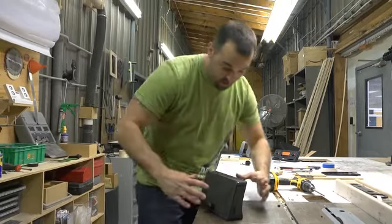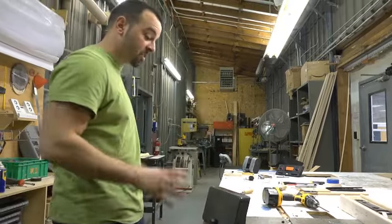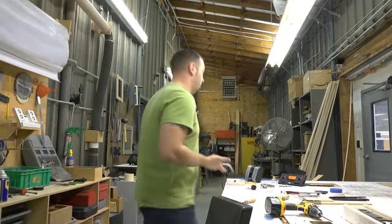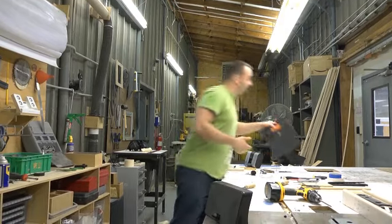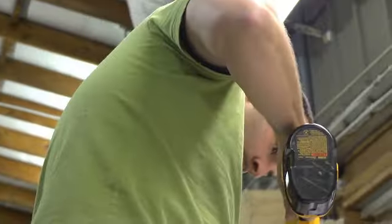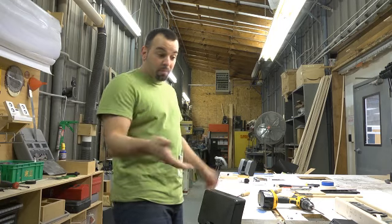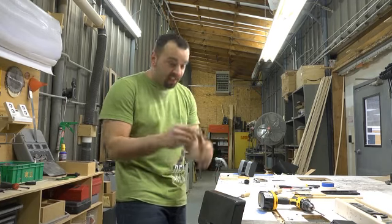If it is doing this, you can actually squeeze the cabinet and hold it, and then you'll actually hear the low frequency pick up just by making this thing tight. A lot of our products that you can see underneath actually have a lot of screws that hold it, so this thing front to back is tied together so it's not going to flex. Making the box so it doesn't flex doesn't cost you money in speakers or electronics — it's free. If you do that right up front, you're going to get a better product, all the time.